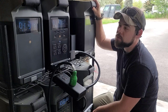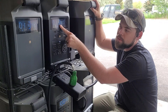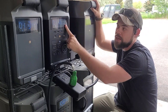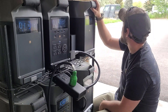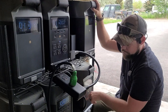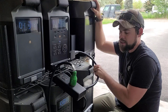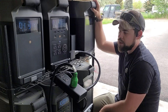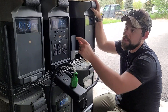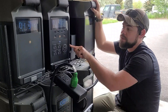About 5:20 in the afternoon — I've been gone 11 or 12 hours. The top unit only got up to 36%. I did turn off the duck light so it wasn't draining all day. It looks like it got a charge and has just been holding steady. We've had overcast all day. The bottom unit, which is hardly running anything, is at 100%. For tonight I'm going to swap this leg — the right side of the electrical panel — to the bottom unit, because 36% is probably not going to be enough to get through the whole night.